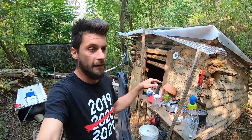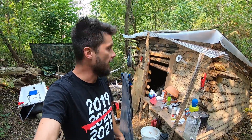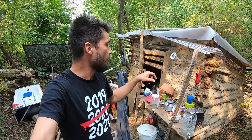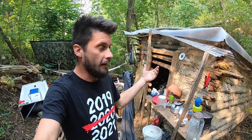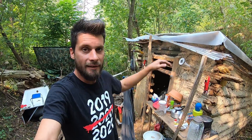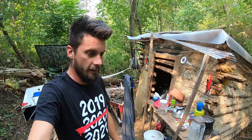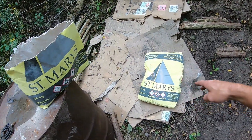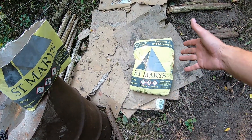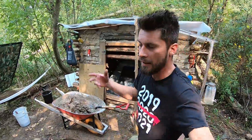What I really like about this cabin is all the building material — about 95% of it was sourced from this location. We've got dead cedar logs and I used the actual dirt from the area here. The only thing I really brought down was a few bags of cement and the plastic and tar for the roof. For cement I've been using Type N masonry cement, that you normally mix with sand for brick, but you could bring Portland or Type S or whatever — any sort of cement that you'd mix with sand or gravel or dirt.